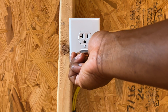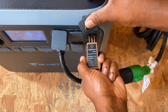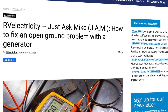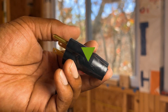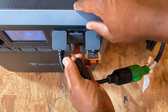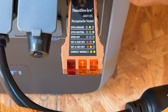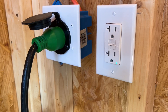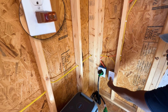After I wire up any electrical outlet, I always use a receptacle tester to check my work, and I soon found out my outlets were showing an open ground. After some research, I found the issue wasn't with any of my wiring, but the fact that most portable power stations do not have the neutral and ground bonded. To fix this issue was quite simple since the company Southwire makes a ground bonding plug that can be plugged into the power station to create the neutral ground bonding that is needed. I really like this non-permanent solution since I wanted to leave my main electrical panel wired as a sub-panel in case in the future I wanted to feed power to the shed from my home. Lastly, I checked my GFCI outlet to make sure it was working correctly, as well as the outlets connected to the GFCI.